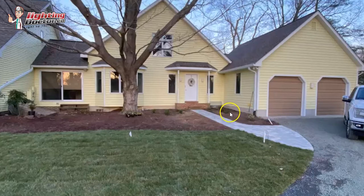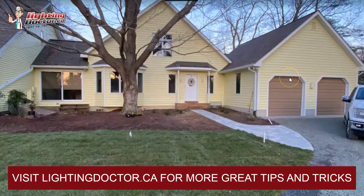To eliminate any dark spots, put another accent light just behind this bush under the window to highlight this wall area, so as you're walking around you don't see a big dark spot in this corner. Continue that theme around the house — another accent light shining straight up to get the second-story peak, and probably one more underneath this window. You're not aiming into the window; you're really just trying to highlight the facade of the house to balance this whole front section.